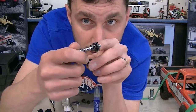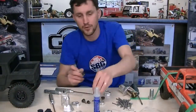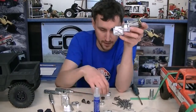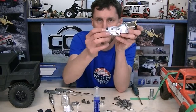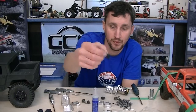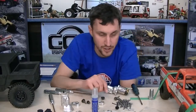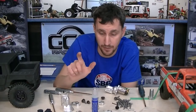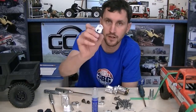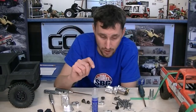To do so, we had to get a new design for a full custom gear and all-new shaft, and get the spacing all perfect. When you take this apart to make this happen, first take the back cover off — four screws, pull off the back cover. Then take out the black shaft with the gear on it. Inside this little back cover are two bearings. They might be stuck on the shaft, but the two bearings have to get split up. One of them is just a spacer; the other bearing is actually being used as a bearing. The small bearing is going to go back inside the casing. The big bearing is going to come out and get used somewhere else.